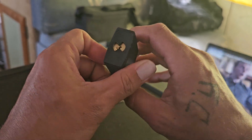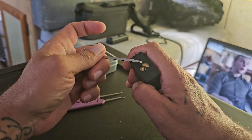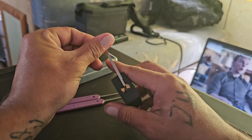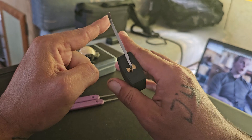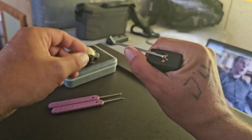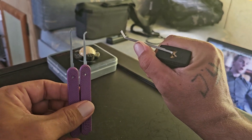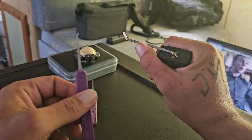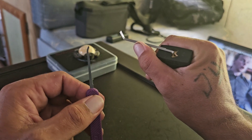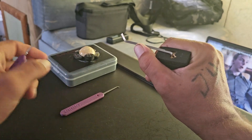To get into this one, I'm going to use a covert instrument turning tool, 30 thousandths, top of the keyway. You have to come all the way up here and put it in this awkward position for a left-handed person. What's different about this lock than most other locks is I'm going to have to use two separate picks to get in there — the Peterson short hook in 18 thousandths and then the long hook in 18 thousandths.